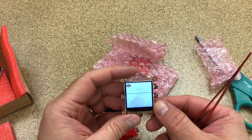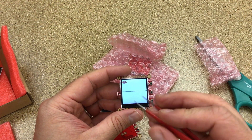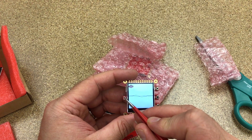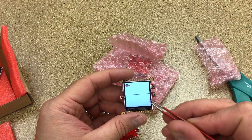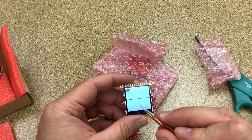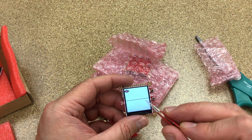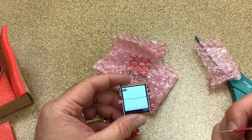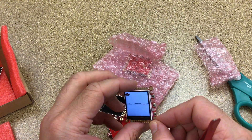We have it working. The firmware I got running to test the out-of-the-box configuration reads the bottom port MEMS microphone, buffers a little chunk of data, and dumps it to the screen. The refresh rate can get pretty fast depending on what you're doing — the SPI rate to the display somewhat limits your frame rate unless you're willing to overclock it, but I'm probably getting 20 to 25 frames per second. So you can get some neat animations and cool graphics applications out of this processor.